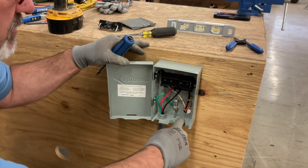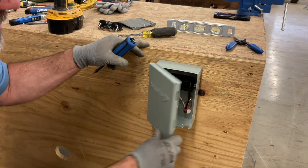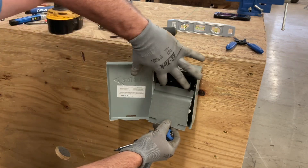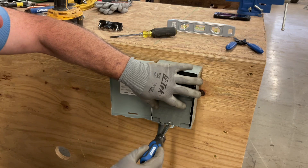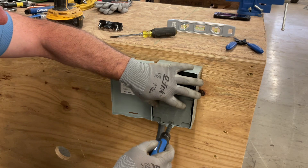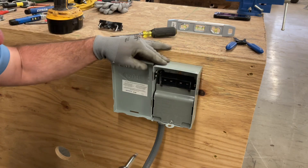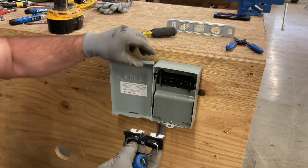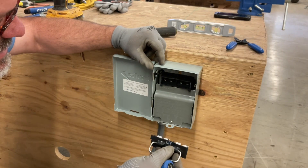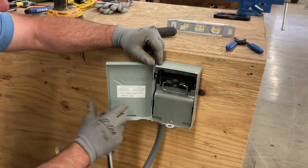Before we put the safety cover back on, there's one thing we need to do: pull out this tab on the bottom — that's what holds the door in place, which keeps it secure. We need to bring that around, then we can put the safety cover on. That just goes up under these two front tabs, and then we tighten our screw. Now we are ready to close up. We still have the plug out, so we haven't connected anything to our unit yet and haven't turned on power. We can put it in the off position and slide it back in and close up our door.